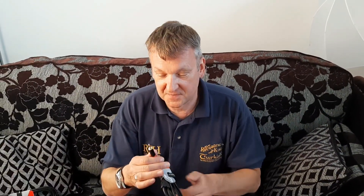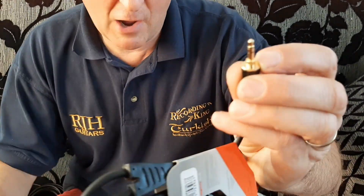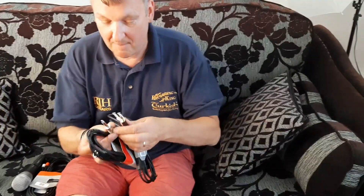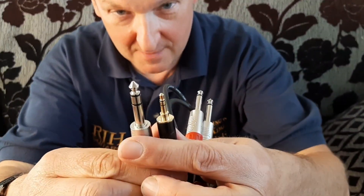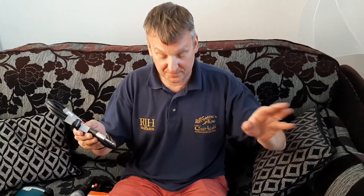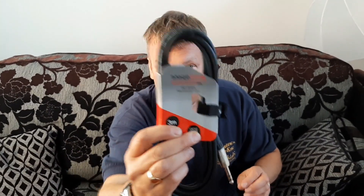I could go into it in a lot more detail, but I might end up losing a lot of people — including myself. One more thing: if you've got an output like that going into your phone, don't try connecting it into a balanced input. Because what happens is the differential op-amp will cancel out the left and the right, and all you'll be left with is a lot of mush. So don't try connecting an unbalanced stereo input into a balanced input — that's the tip of the day. This video has been brought to you by Stagecore Cables.